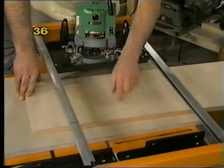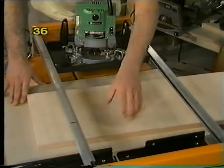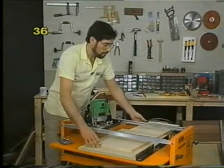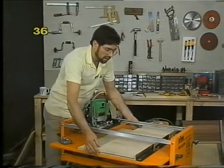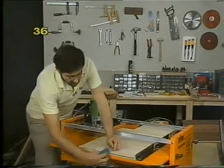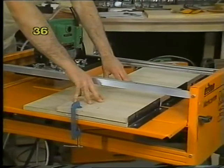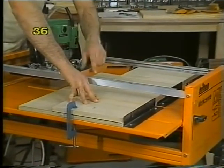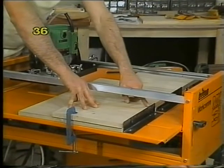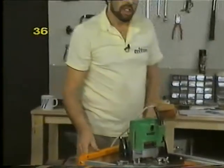Put your board in position and hold it very firmly, or preferably clamp it. The need for the clamp will be obvious the first time you use the router because there's a tremendous tendency for the wood to move sideways — the router cutter will want to move the wood. So clamp it down or have sandpaper-lined fences. Because you're not cutting all the way through but just doing a trench, you want that trench to be the same depth all the way along.